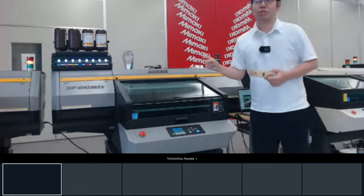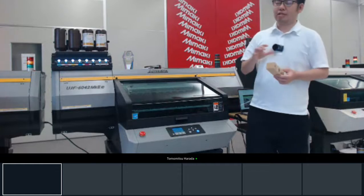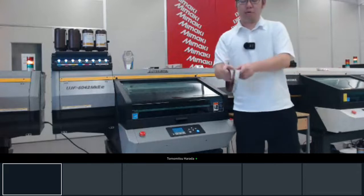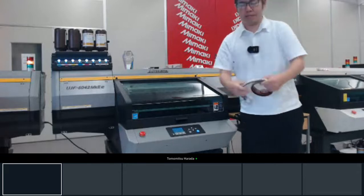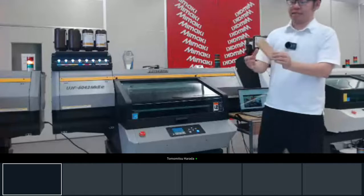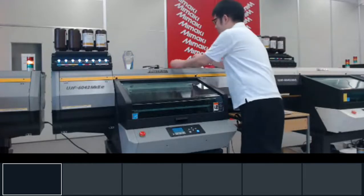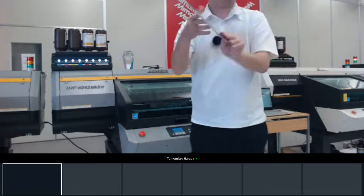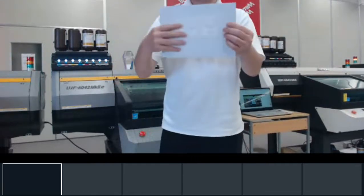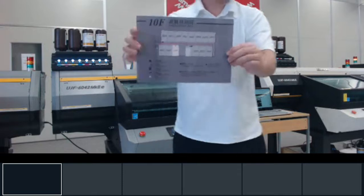We also have LUS 120 ink, which is a more flexible ink. So flexible ink works for printing on a phone case or a belt, for stretch or bending purposes. So let me give you some understanding of the application. For the hard ink, for example, this is a small acrylic signage printed with black, the white behind, and the color sandwiched on the other side of the acrylic.